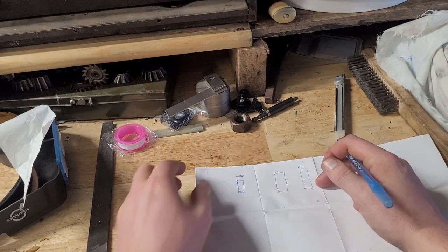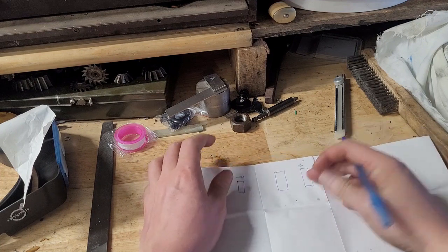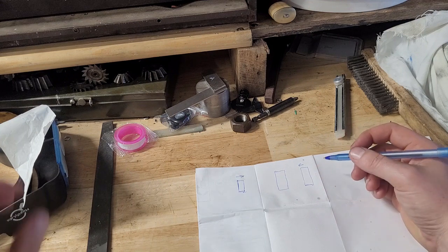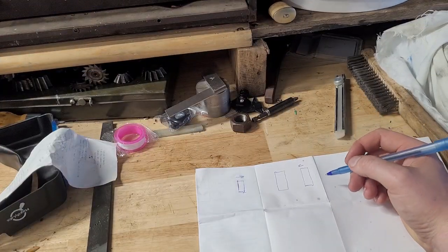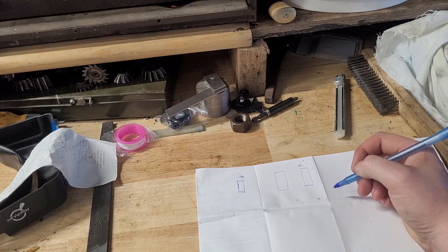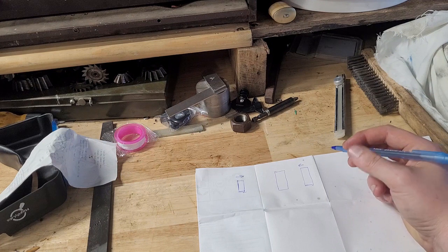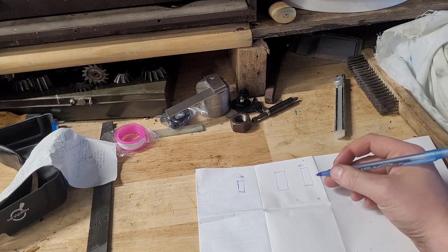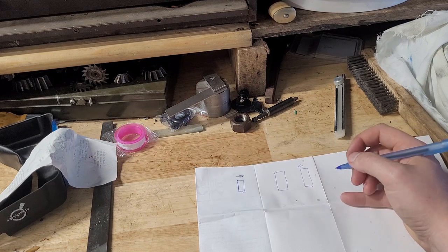Now, this paper is about 3/1000ths or 4/1000ths of an inch thick. It works out to shim very close to 3/1000ths of an inch once it's compressed by the mag chuck. This is good for about 1.5 thousandths of correction. Some of the cheaper rolling papers are actually pretty good shim stock, and I do not smoke rollies or partake in the devil's lettuce, so those don't really show up in my shop often. So I tend to just refer to this grinding in a shim.